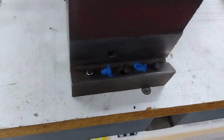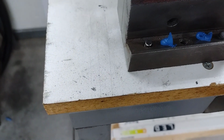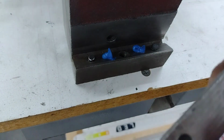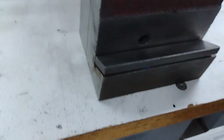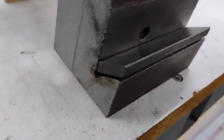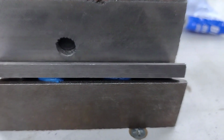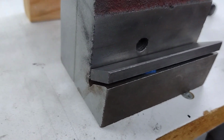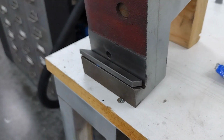So here you can see I put the 2 beads, making sure not to touch anything. And now I'm just going to take the gib. You want to make sure you have it in the position it's going to go in so you're not fumbling around. And now I'm just going to carefully push it down. Seeing that I'm parallel, I'm going to let it set up overnight. You can see the silicone in there. All right, this side probably would have liked a little bit more, but I think it'll be adequate. So we'll let this dry overnight, and we'll regroup tomorrow and see how it works.